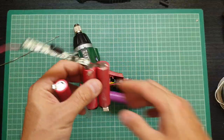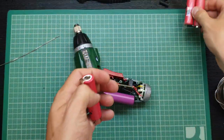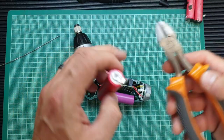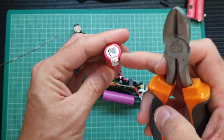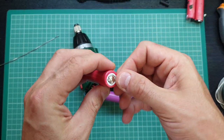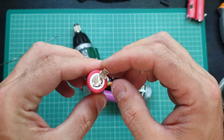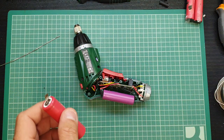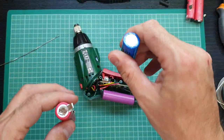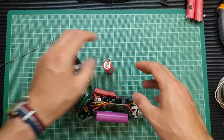I've got my battery extracted. All it took was some snips to gingerly cut the solder tabs in between. You've got to be careful when doing that, especially on the positive side, because if the metal were to cut through the outer insulation it may short to the actual casing, which could be quite dangerous — especially if these are fully charged. What I've done is just left a short amount of the solder tag already there. You could solder direct to the battery, but I don't recommend it as you might damage the battery or cause it to explode — you don't want to be heating these up too much.